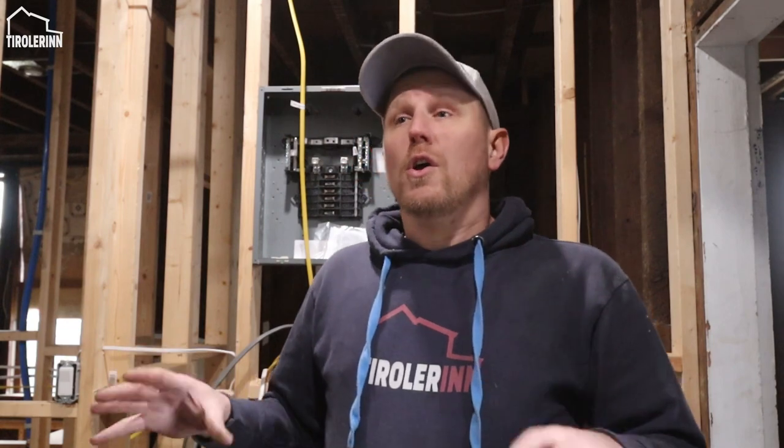The electrician just left and we had a pretty good conversation. He's willing to help me, though he's not feeling 100% comfortable doing outside upgrades. Since we have two actual service lines coming into the building - one with a meter, one without - we already have two 200-amp panels in the basement. He's at least willing to do all the work in the basement to the sub-panels, splitting it out from those two panels. I still need to find someone for the exterior upgrades.